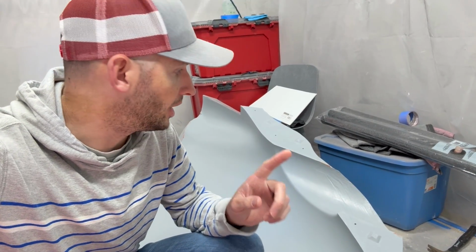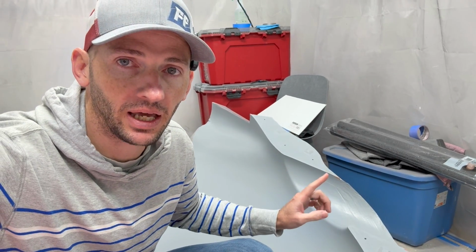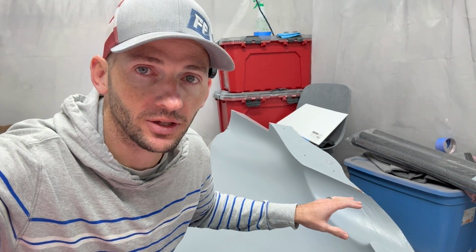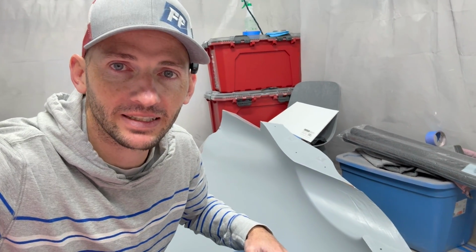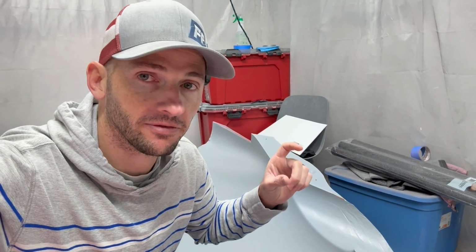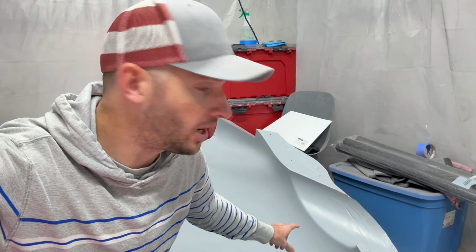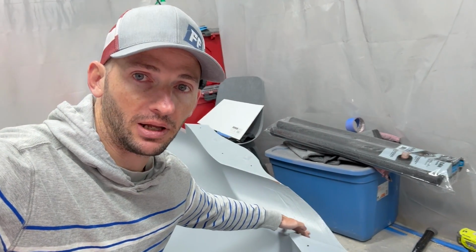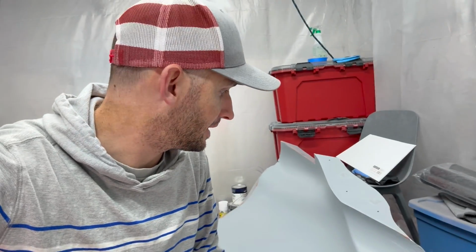The other thing I wanted to touch on was the strategy I used for duct tape and basically where I used it. So the duct tape basically covered areas on the plug that, in hindsight, I was too lazy to actually make really pretty, but I still needed an extra length of space for my flange so that it'll help with the layup. So on here you can see that basically the plug surface that was clean is everywhere the carbon will get laid up onto, but then the duct tape, I don't care what it looks like because it's not going to affect the look of the part. It just was basically there to extend my plug without me having to actually put in extra effort in high build primer, sanding, and making it look nice.